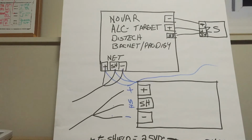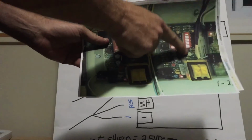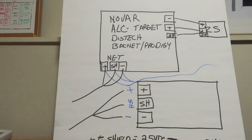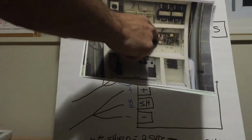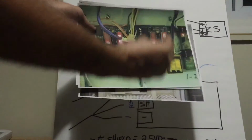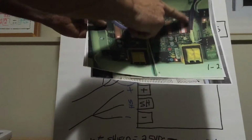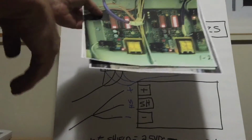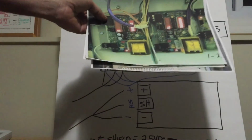Another thing to look for, guys, is this set of LEDs on this diag board, this is in an IOP panel at a Target. You can see it right here, it's just zoomed in. If these are flashing up, up, up, up, and just non-stop, that means it's resetting. And if it's resetting, it's trying to get rid of noise. It's got a bunch of noise on the line.